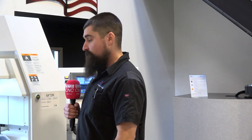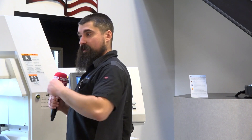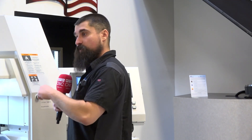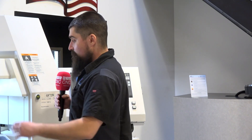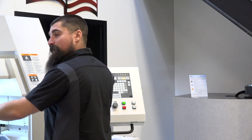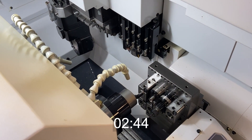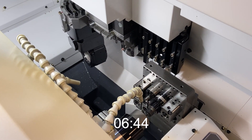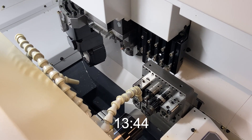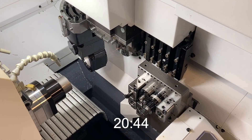For some of the experts, things to look out for: about halfway through the main spindle side, the live tools will move over and we're going to be milling a hex onto the part to showcase the milling features. So we'll be doing a turn first, then milling a hex, and then deburring tools will be deburring all the broken edges. For the real expert guys, watch what the back spindle is doing because that's going to be moving independently — you're going to see two things happening at once. We're going to be milling on the back side as well, deburring the hex we machined on the front side so the part can come out completely deburred, ready to put into a box and send to the customer.